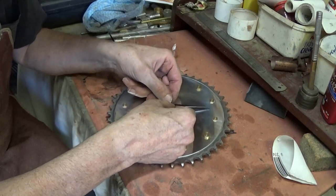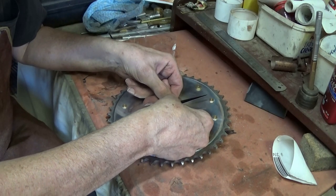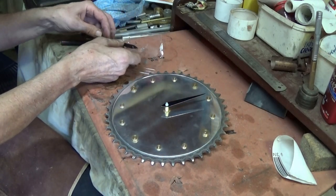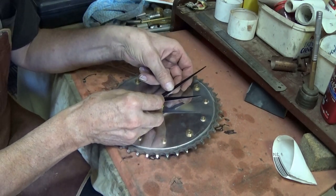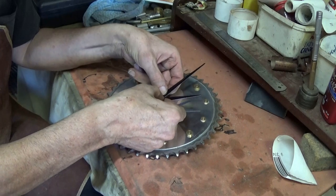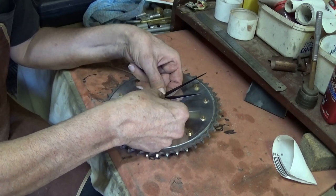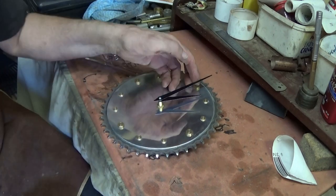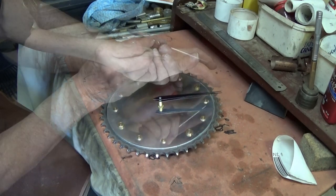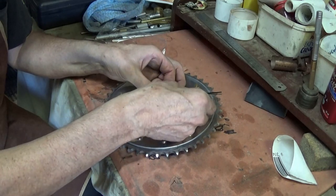The hands just press into position. They are very lightweight and very fiddly, so it is very easy to bend them accidentally, so I have to take a little bit of effort to just do this right. So there is the hour hand done, time for the minute hand — it goes on the next graduation up. It has got to be aligned very perfectly for it to slide down into its little position. Making sure they don't touch each other, and then the second hand goes into the centre. There is a little pin that comes up from the centre that the second hand goes into.